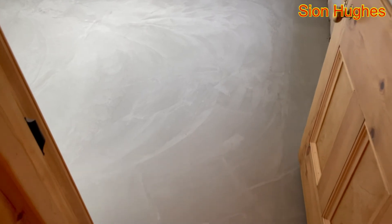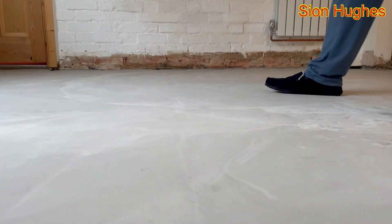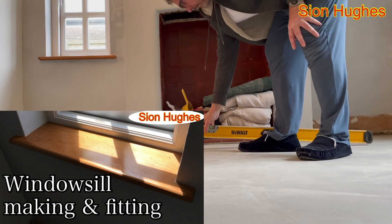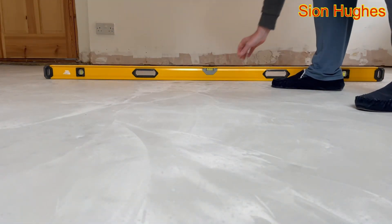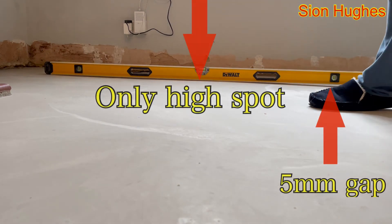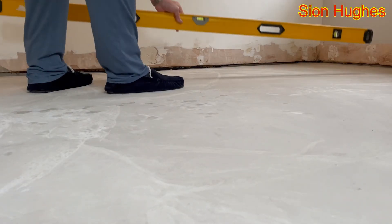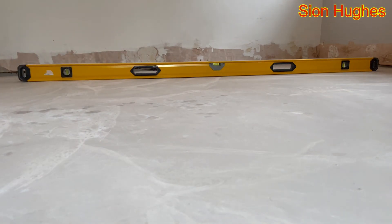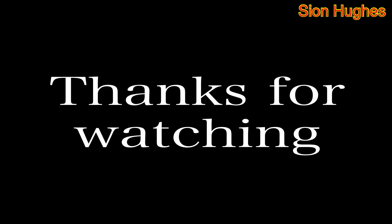I didn't walk on it until about four hours after that, in the evening when I closed all the windows and put a dehumidifier in the room and left that running for about two days to get the water out. It's a slightly lighter color now. I'm laying a level down and it's all very smooth and very flat — that's very reassuring. But as I go to the other side of the room you can just see where that high spot was around that bubble. I'm going to be laying carpet in this room, but were I laying another wood floor I should really have a completely flat surface. Thanks for watching — this was my first time and you can do it. Please consider subscribing.